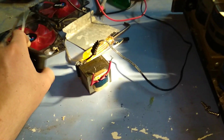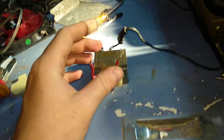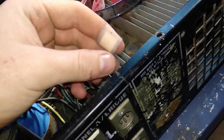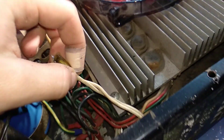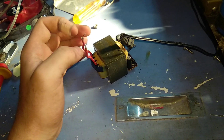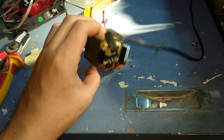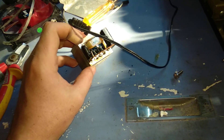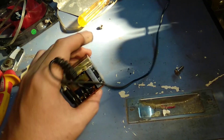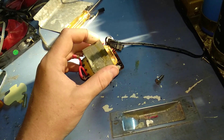And here's our freshly opened power supply. This is the remnants of the old case, but you can see it's quite a nice self-contained unit which I was hoping for. You can see these two leads here are going to be easy to solder onto these two right here — heat shrink up, unlike these old protective sleeves where one of them wasn't even over the connector. So that's going to be done better. All the 240 volt is contained once I put these two bits of heat shrink on, and all this on the secondary is just 12 volt. Here we've got the four diodes which make up the bridge rectifier, something here which I believe is some sort of over-current protection — oh I think it's a fuse — and right here we've just got its smoothing capacitor. Quite a nice unit actually, and should be more than capable of driving 12 watts.